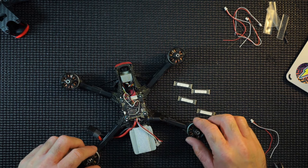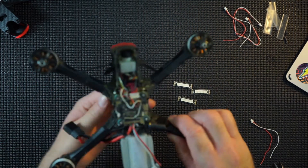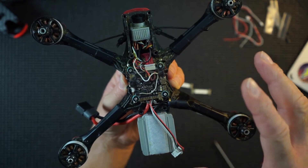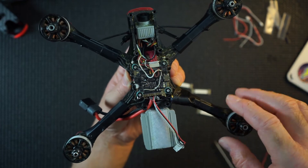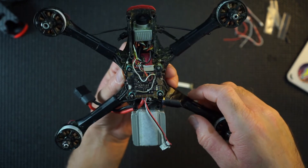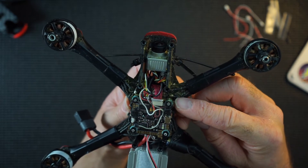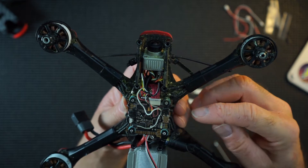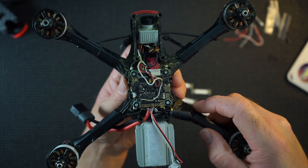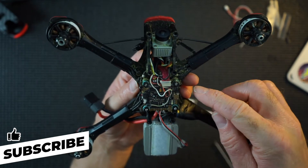Here we have my old original Apex where I've just taken the lid off. I've unplugged the DJI unit and taken the antennas out. This is my F7 board — it's a bit of a state in here. Later on I will be taking this quad completely apart and rebuilding it: new motors, new board, everything. What you've got here is three little pins or soldering pads — these are your LED board pads. They go forward and back, so you've got five volt, ground and LED wire — and the other way around is five volt, ground, LED on the back. I've double-checked this on the wiring diagram. Always check a wiring diagram before you start — it's always worth double checking to make sure you get it all done correctly.